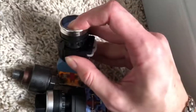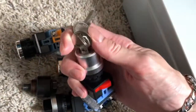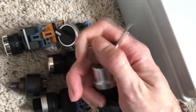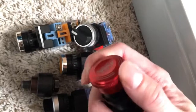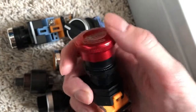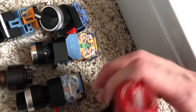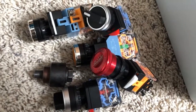I've got these little illuminated buttons — a blue one, a dual dispatch, a yellow one for floors, and this one's for a flying coaster. I've got two switches — that'll be for the gates and restraints. I've got a little key panel enable switch, so you put a key in and you can turn it on and off. This will be the main panel power switch. And I've got this e-stop button — it presses down and locks there until you twist it, then it goes back up and either closes or opens the circuit depending on which contact block you use.